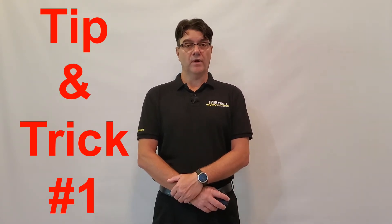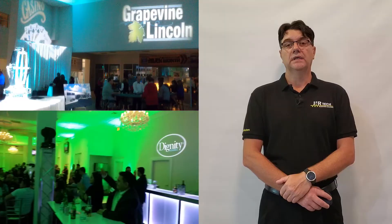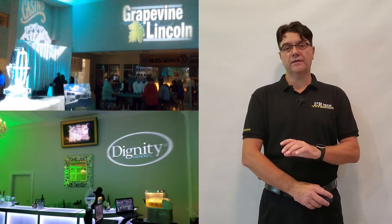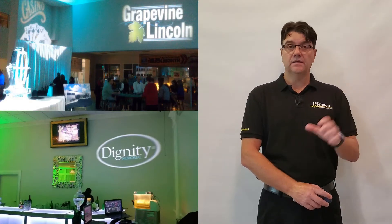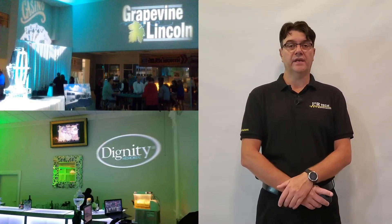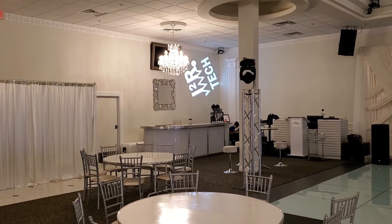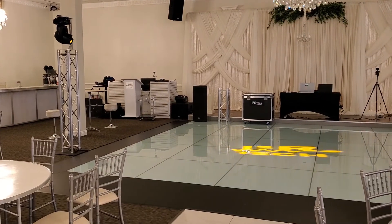Tip and trick number one. There are many Moving Heads that allow for a custom Gobo to be used. This is great for projecting customized logos or monograms. In general, these Gobos can rotate so they could be aligned, but the downside is that hardly any Moving Head remembers the angular rotation of a rotating Gobo when it is recalled. So, even if the logo or monogram was aligned when creating a chase, later, when the chase is recalled, the logo or monogram might come out misaligned. A trick to avoid this annoyance is to always keep the Gobo slowly rotating — then it will never be misaligned.